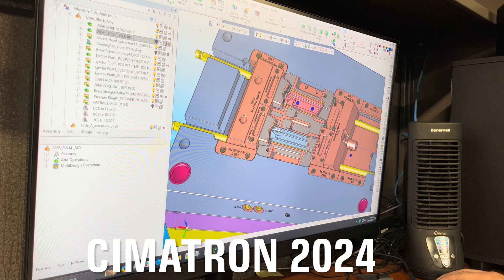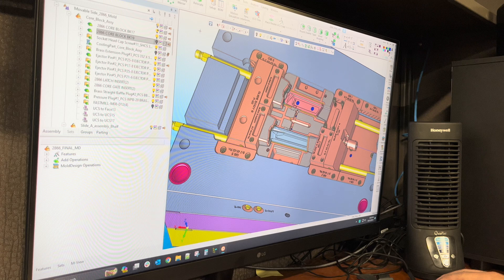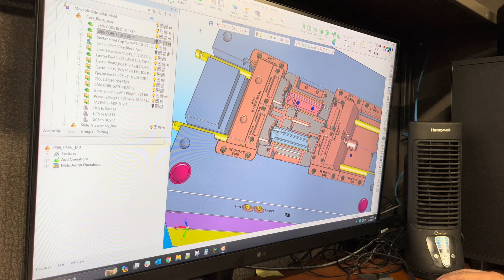I'm here with Brandon. We're looking at a mold design for a Glock magazine, and the first thing we want to do is decide how to mount these slides in the 5-axis so that we can go through the wire machine, sinker, and all the operations we can in the 5-axis. This is going to be thinking about five steps ahead.